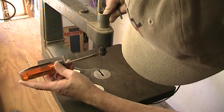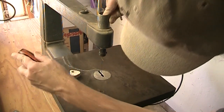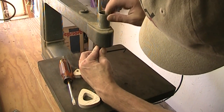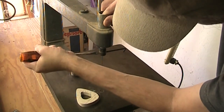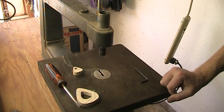The tricky part is I kind of have to hold it there with my finger and then tighten this one up — not all the way. Then I hold it there and tighten it with the Allen wrench, then tighten this one again. So it's kind of a pain to change these blades. This is one of the reasons I don't use this saw very often, because that's kind of hard.